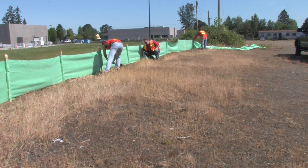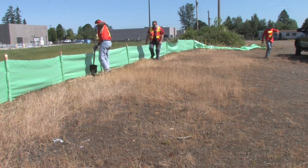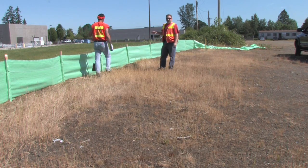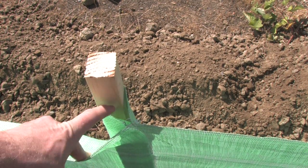We don't want this to be able to pull out as it gets loaded with water, so we're putting our posts in sort of tight to the back of the trench, putting the rock backfill in, packing it down, doing a nice good job. This particular silt fence has the post sewn in the pocket — that means each post is stitched into its own pocket right here.